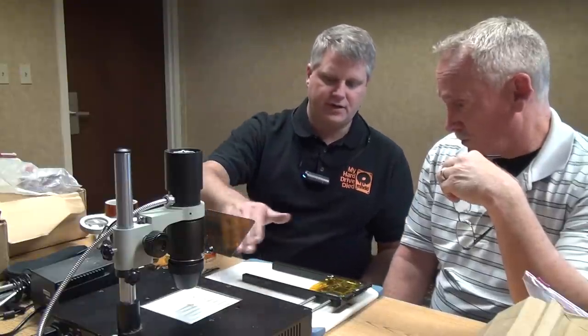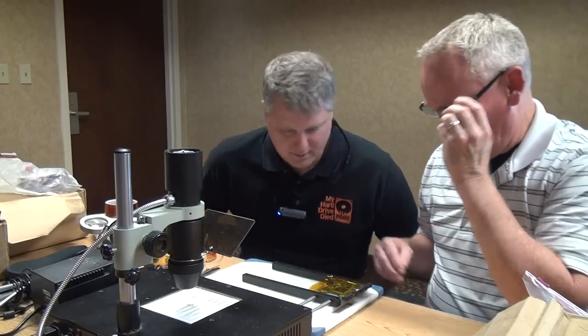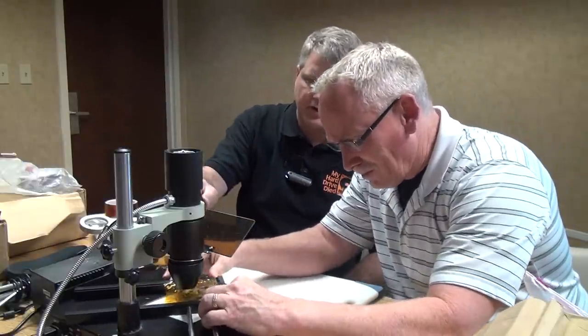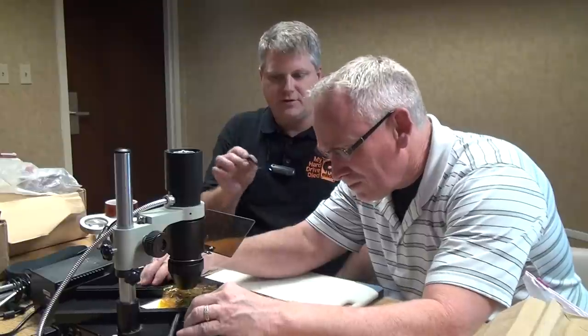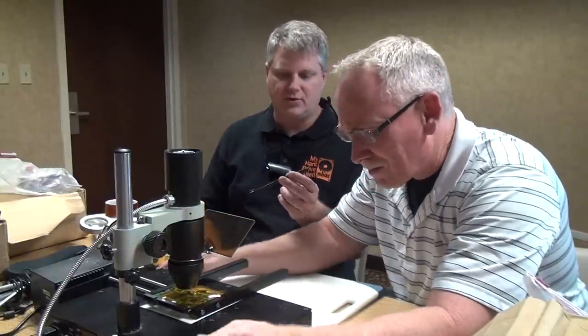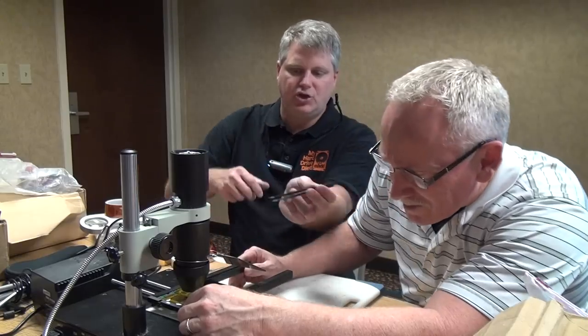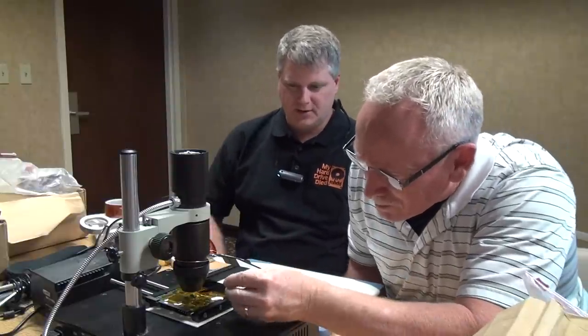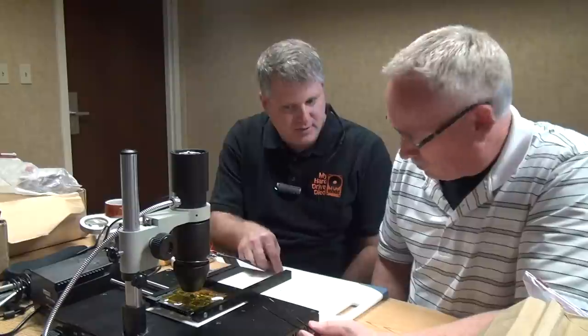Now we slide this up underneath. Are you right-handed or left-handed? Left-handed. If you're left-handed, get it in a comfortable spot because you're going to grab the chip from the edges — not where the legs are — from the two sides. Make sure the tweezers are comfortable enough that while it's on and the flap is down, you can reach in there and grab the two sides of the chip and pick it up and pull it out. The important thing is not to move it around or drag it, because it'll rub the solder all over the pads. You want to grab it, lift straight up, then come out and put it down.